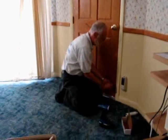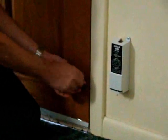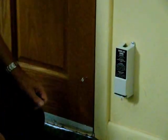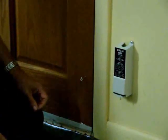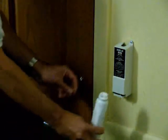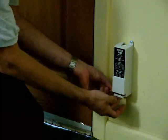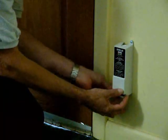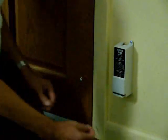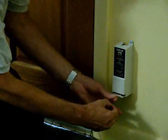That would take the other end of the trip line. As you can see, it's a very short space here. It's only a small amount of trip line that we will need to do this job. The unit is shipped with 16 feet of trip line for other applications requiring more of it. Next step is to install the aerosol can. It slips into the bottom of the unit, and then there's a can retainer pin that goes in to hold the can in place.